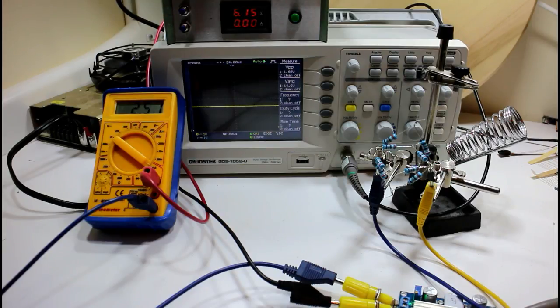That's as far as I can go — I have no big power resistor to test the full 75-watt maximum rating. But that's still pretty impressive, and now you have an idea of how to handle higher powers with resistors using series and parallel configurations.